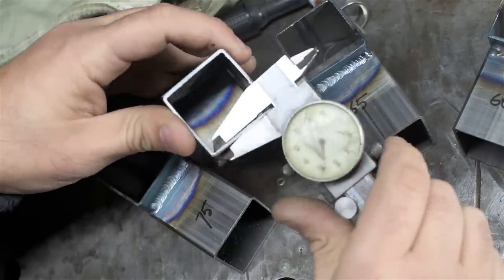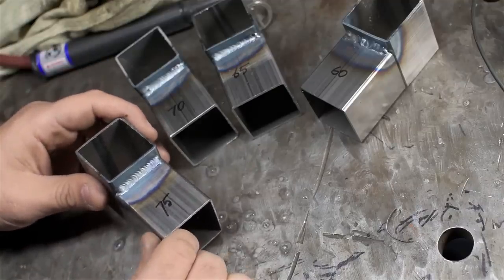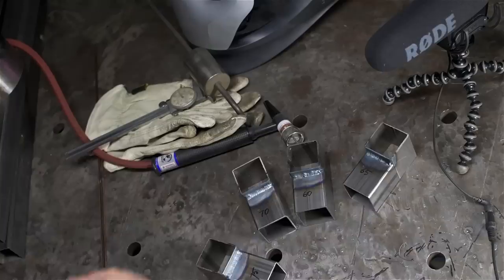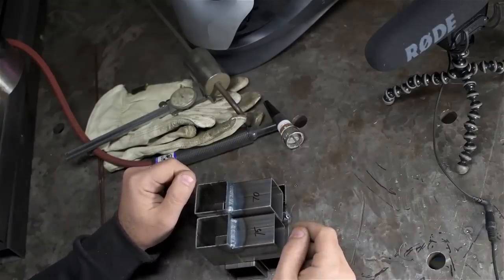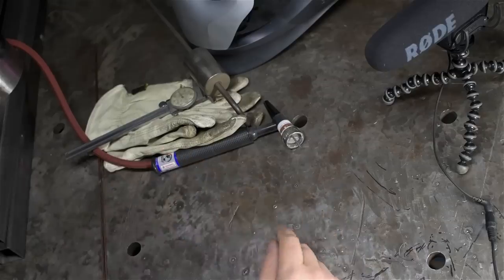The tubing is 60 thou, so the oversized filler rod is why I was feeling that sticking during welding and why I needed a few more amps. Does that mean my chart was right all along? Probably not - but it goes to show the best amperage control is the one between your ears. This part has gotten kind of long, so I'm going to spin this off into a two-parter. I feel a little weird about posting a TIG welding cart build video without actually building the cart, but give me a few more days and I'll have you the rest.